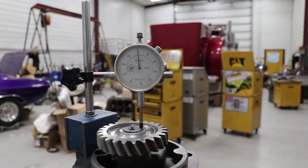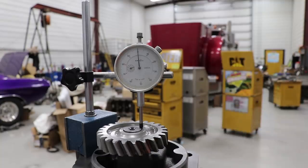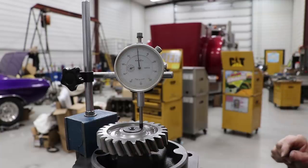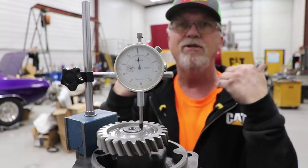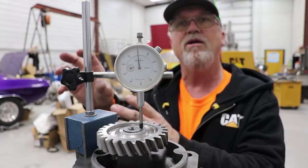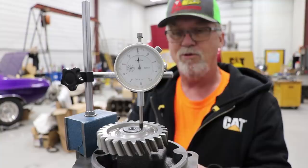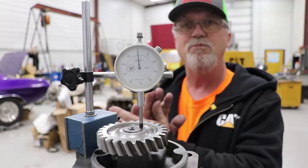So that's how you would check the backlash. Now let's set it up — excuse me, that's how you're going to check the end play. Basically what that is, is the distance between the end plate and the bottom of the housing. It has seven thousandths of clearance between the gears. What's going to happen is as it pumps, the oil is going to spill up through that. The seven thousandths is all going to be on the back side. Why? Because that's a helical cut gear, and helical gears are pulling that gear in towards the engine, so the pump gear is up against the bottom of the housing all the time.